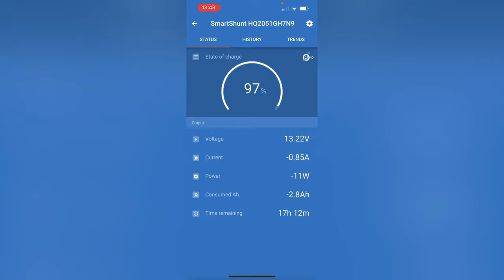We've turned off the heater function and here you can see that our amp draw is significantly less — about a seven to eight amp difference just by turning off the heating function. Keep that in mind: if you're going to be in a cold climate, you can manually turn that heat function off or have it set to automatic — it's up to you. If the dish is ground-mounted, you can just go wipe snow off it if you really need to.